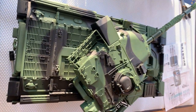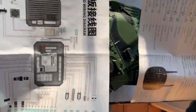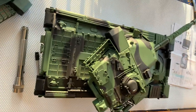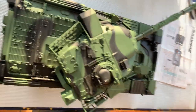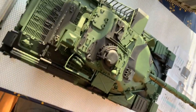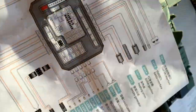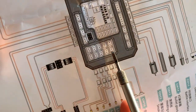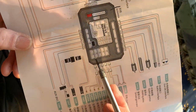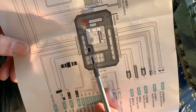Everything should work as normal. You have all the MG lights — just follow the instructions, both papers. Making sure that your positive and negative are the right way around on the board. Plug them in — the LED, positive and negative. If you look on the instructions, your positive is on the right, your negative is on the left. That's for all the LEDs wherever you plug in your lights: MG, headlights, brake lights — positive right, negative left.